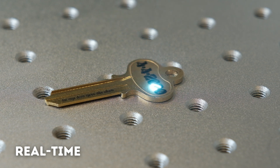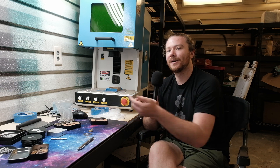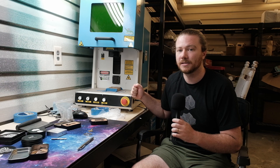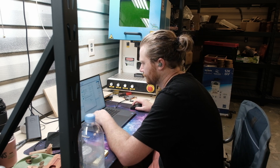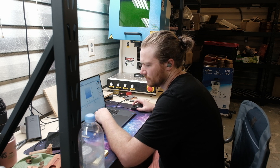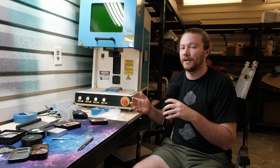When you're batching stuff out, it's got a start button that is so nice because EZCAD 3 is a little bit of a nightmare and is prone to crashing. It's just nice not touching the laptop at all. When everything's set up, you just hit the start button every single time and it does exactly what you need. You do have to have your laptop hooked up to this for it to work, although it does not require Wi-Fi — I don't have Wi-Fi here in my barn. Your computer doesn't even have to be that nice; a really basic laptop is all you really need. I would highly recommend getting a dedicated laptop just for your laser. The fan runs when it's turned on all the time — it doesn't just turn on when you're running a program, so it is constantly pulling stuff out.